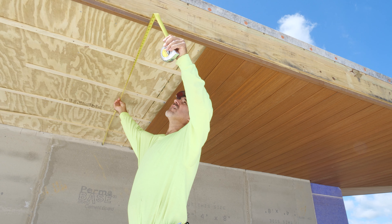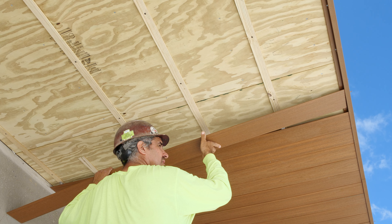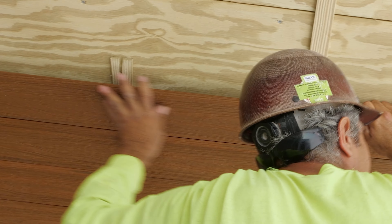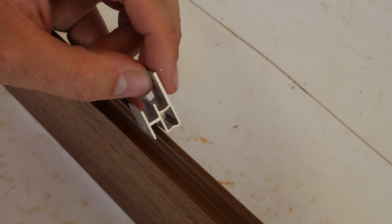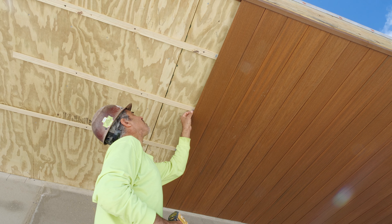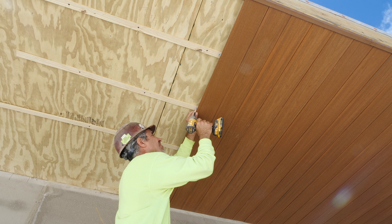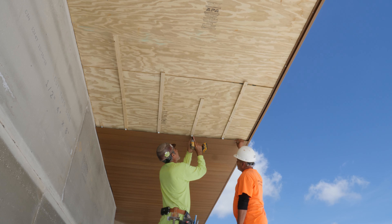Now you're ready to install the boards. Measure and cut siding boards to the appropriate length, leaving room inside the trim for expansion and contraction per the table in the installation guide. Use the AW08 aluminum clips to hold the hanging board to each furring strip or stud. The installation clip holds the boards perfectly and allows the boards to expand and contract. Refer to the installation guide for more details on the placement of screws and clips for particular installations.